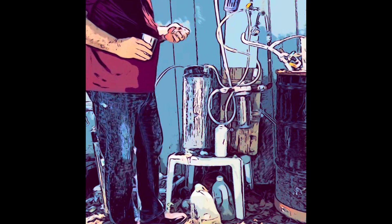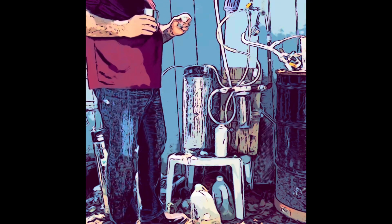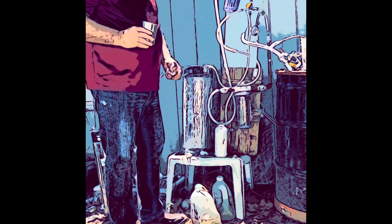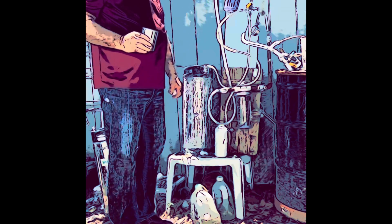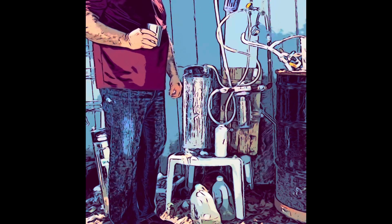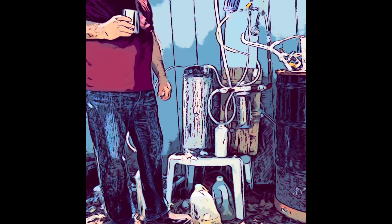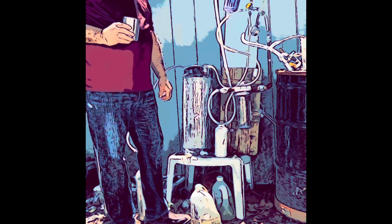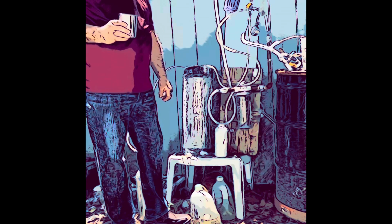Now, the ideal way to do this is to get dirty aluminum from restaurants. Foil containers that they bake in, disposable stuff that they're just going to throw in the trash. Get them to throw it in a recycle type container, and then periodically go and get that from them. At that point, I would bring it home, and I have a system where I put the aluminum into a stainless steel pot, put it in my burn barrel. Then I burn my cardboard in the burn barrel.